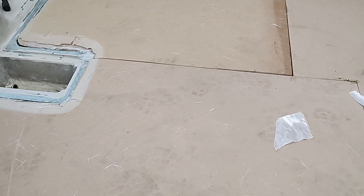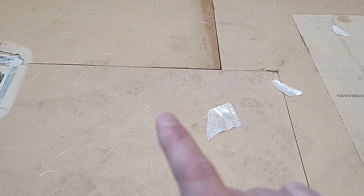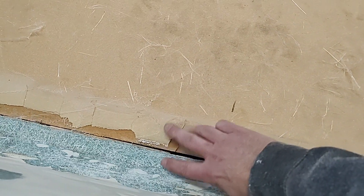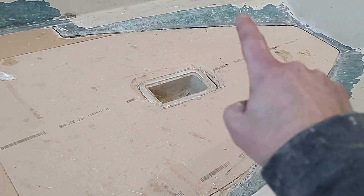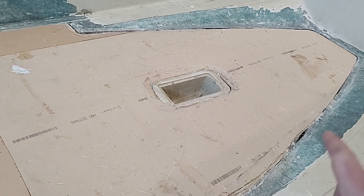You're going to layer three layers of 1708, and to start with, you have sort of a peanut butter. Then you have this kind of six-inch cloth that you layer on top, and then on top of that you go with your 1708. Everything's numbered. The idea is to layer it in so that you get progressively wider, and it all becomes one piece.